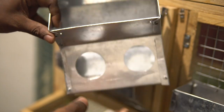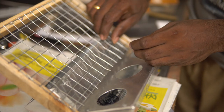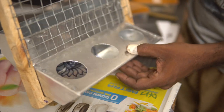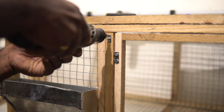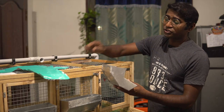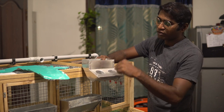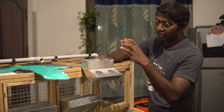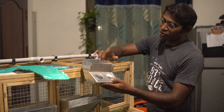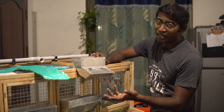This one is the smallest of the lot — it has only two holes. I had not fixed the mesh on the door of the cage yet, so once I placed the feeder on the door I knew how much mesh was needed to cover the empty space. The feeder can be attached to the mesh and the door put back in place. The reason for using 1mm thick aluminum sheet metal is that anything thinner would make drilling these holes really difficult. I only have drill bits, not punch dies, so 1mm aluminum was the best choice.